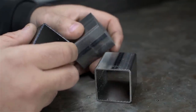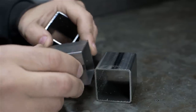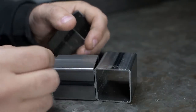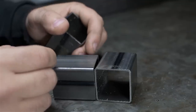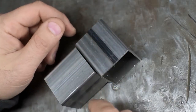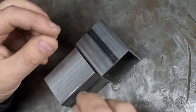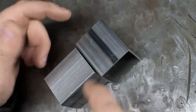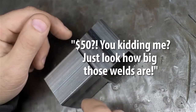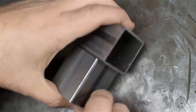I don't know if that rule of thumb is actually true, but it sure sounds convincing. The fact of the matter is your amperage changes based on material and weld type. If you're using a foot controller, set a little higher than you think you'll need and let your feet do the talking. For fun and to get to know the HTP a little better, I'm going to pulse weld everything on this cart - it's thin wall and I'd like decent sized beads, mostly for that macho factor.